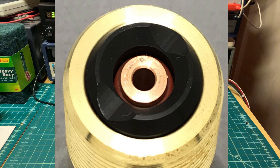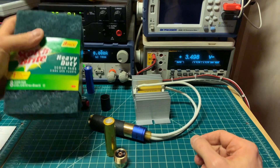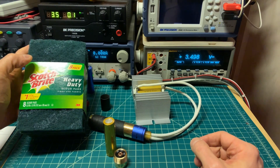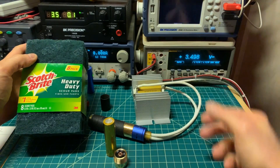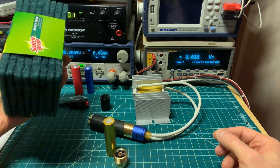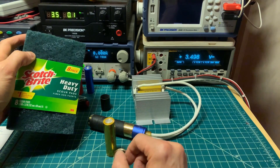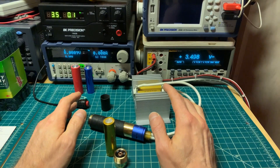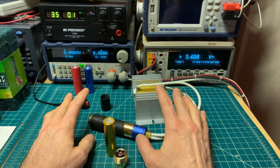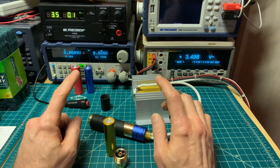That's something you want to address daily. You can use something like these Scotch-Brite pads — they're fantastic for it. The heavy-duty ones. I've seen them listed as number 288 on Amazon — these are tougher than the regular green and yellow dishwashing scrubber pads. These are good for light damage like this. Be careful on plated contacts though, because you don't want to keep abrading through the plating. These performed well enough, and I didn't feel any hot spots, so I'm not going to do thermal testing.